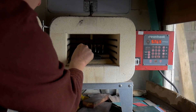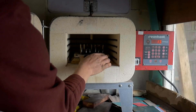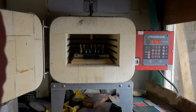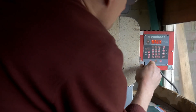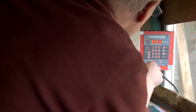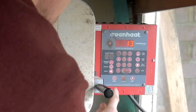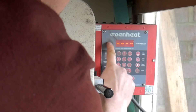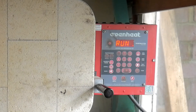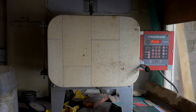That's the blades loaded in. I've got a little block of steel that I use for preheating the quench tank down there. The Ramp Master controller is already programmed, so all I've got to do is recall the program — which is number two — run it, and the kiln does its thing. It will do all the ramp and holds to the temperature that I want.